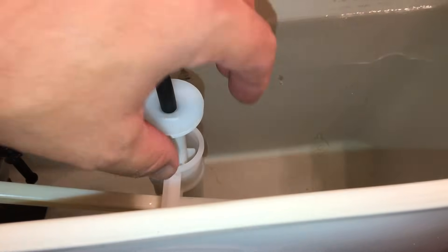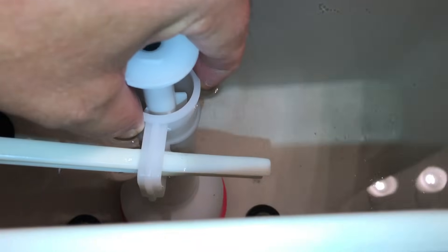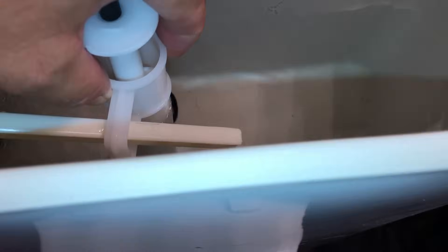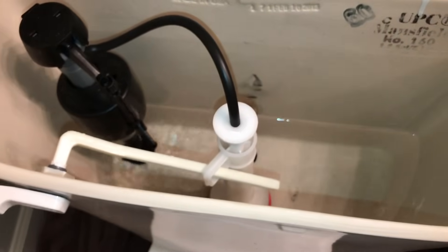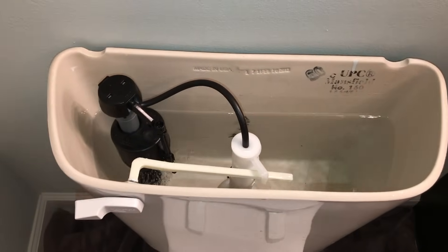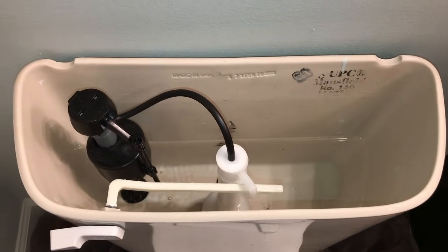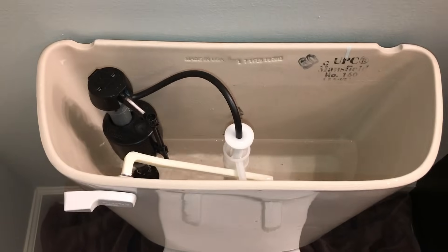On the first test flush, instead of pushing down on the flush lever, I like to reach in and grab the tip of the flush valve and give it a gentle pull, letting the water slowly leach out a little bit, then stop it and check for any other leaks. If there are none, then I'll go ahead and let it flush all the way. That way you have better control over the flow of water out of the tank and you can push the flush valve back down if you encounter a leak. No problems there — let's give this thing a real flush and call this project complete. If this video helped you out, I'd appreciate a thumbs up. If you have any comments or questions, please leave them below and consider subscribing to my channel. Thank you for taking the time to watch.